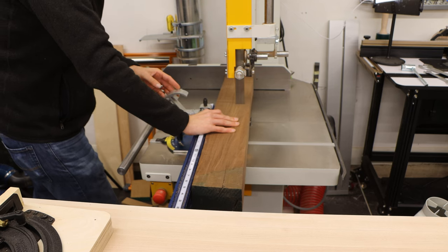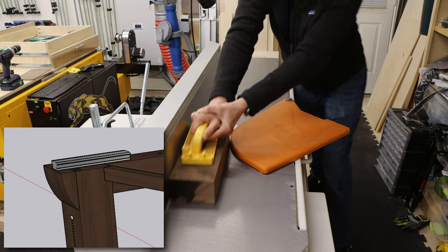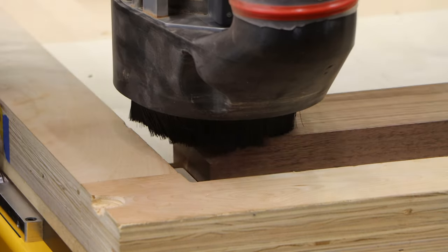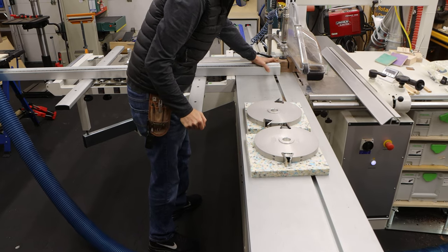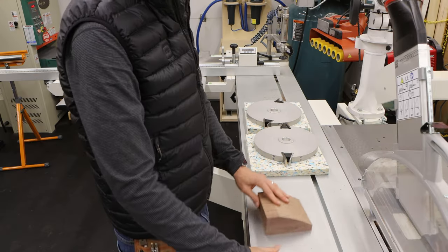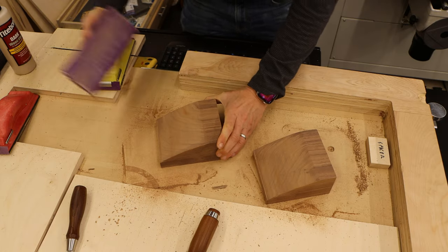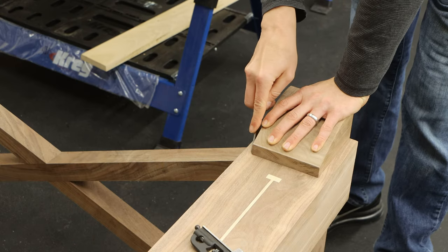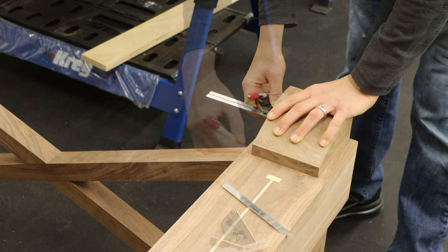The next step is to take our perfectly good base and immediately change it. The sliding top can cantilever out seven inches from the edge of the bench, and for it to do that, it has to have a linear rail to sit on. The linear rail has to sit on something, so we're going to add an extension to the base for the linear rail to fully rest on. These are made at 12 quarter stock and they're going to be inset into the leg base by one quarter of an inch. They carry a small part of the load of the linear rail and are as much for aesthetics as for functionality.